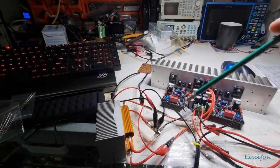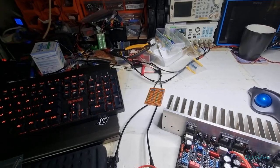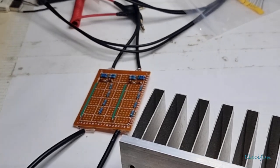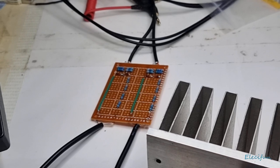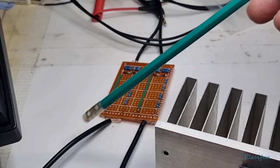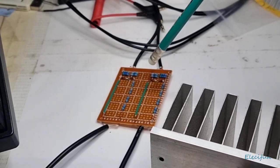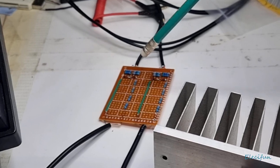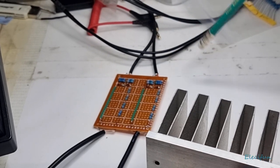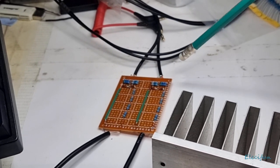I have my probes, which would normally be going off to your oscilloscope, going off to this little circuit here, which is now for two channels, and I will show you in the next video how to set this system up. This is probing off the heat sinks, the dummy loads, and then it goes through this attenuator, and that's attenuated to minus 20 dB. So if I put 10 volts in, I get 1 volt out. Just to keep it simple, 1 volt in, 100 millivolts out.